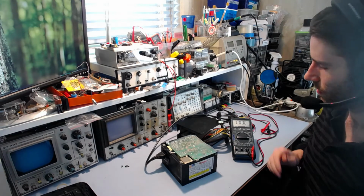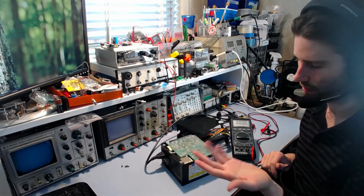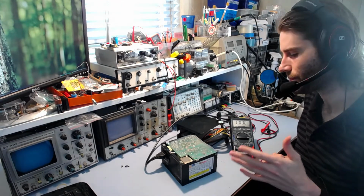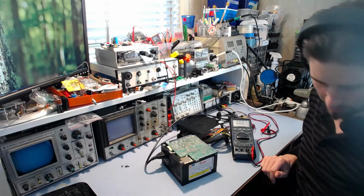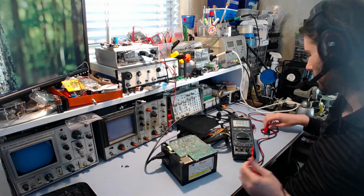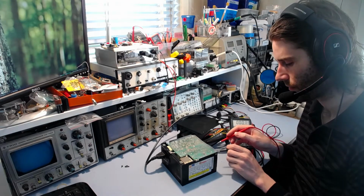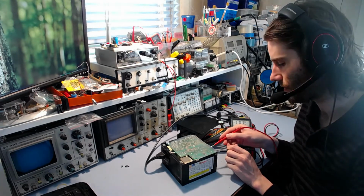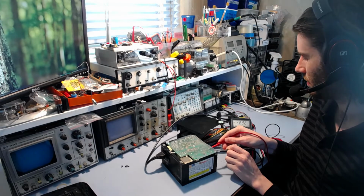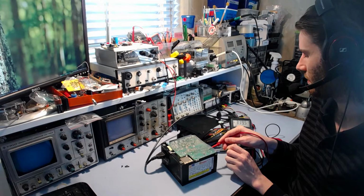That's completely normal. So it tells us the fuse is good, the bridge rectifier is good, all that stuff's fine, the coil is fine. So we've got our mains voltage coming in, rectified, that's good. So I'll just unplug this, and I'll have a look at something else too. If I probe these capacitors again, I'm probing across both of them, they're in series obviously. 320, the voltage is still there, still quite high, and it's dropping, but it's dropping really slowly.